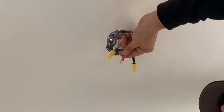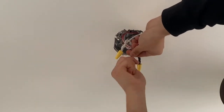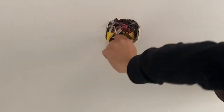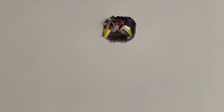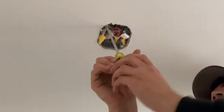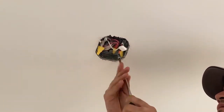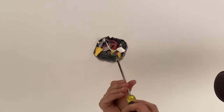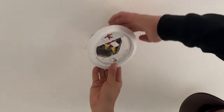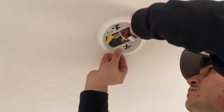That interconnect is what makes it talk to all the other smoke detectors. After that, he's going to simply tuck the wires up into the back of the box to get them out of the way, leaving the whip hanging down, and then he's going to put on the mounting plate. He's got to loosen the screws off first, then he inserts the mounting plate, which goes on clockwise as well.